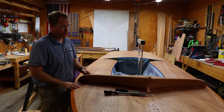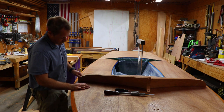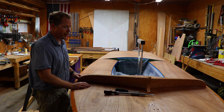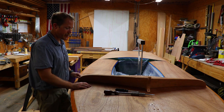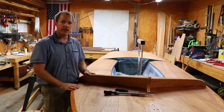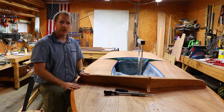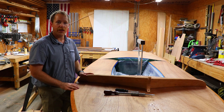Here's the final fit up of the splash guards. We've got a really good fit along the deck. The bevels meet up with the center support really nicely, and they're super sturdy and secure. All I have to do now is detach them and clean up the top edge on the belt sander - I'm going to do that off camera. Then I'll coat them with wood sealer and give them about six coats of varnish so that they're all ready to reinstall once I finish the wood sealer and varnish on the deck. I hope you found it entertaining and useful. I think we learned some good techniques on how to match these bevels and how to scribe these splash guards to fit the deck. If you have any comments or suggestions, please put them down below. Thanks again for watching Make Stuff Nation - don't forget to like, share, and subscribe, and I'll see you next time.